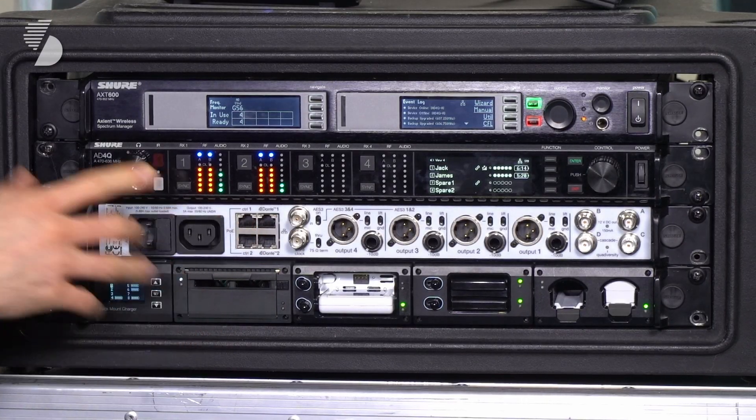Now if you've got a fully switched network infrastructure this is going to be pretty good, because you can move stuff where it needs to be through the switches. The setup we have today has no extra switch, which means that real estate is going to get taken up quite quickly. We're also not worrying about a redundant Dante stream today. So we actually put this in its second mode which is called switched. In switched mode, primary Dante and control goes out on all four ports — way more flexible, so you can do a lot more daisy chaining and you don't need all the switch gear. The only drawback is you lose that redundant Dante stream. It entirely depends on what your priorities are and what your setup is.